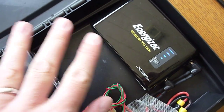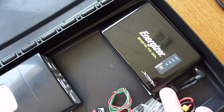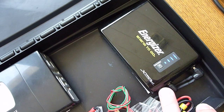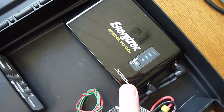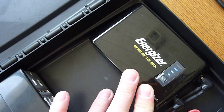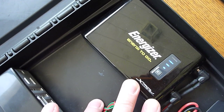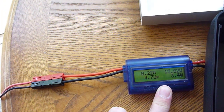The beauty about this system is that there are no solar chargers here. As I discovered, this little lithium power pack requires a 20-volt DC adapter to charge it, and that's about the power range that comes out of a solar panel. It accepts a wide range of input voltage — at the moment it's getting just shy of 16 volts. It's almost acting as though you don't need a solar charge controller, because the charge control electronics are inside. And where you normally have power loss on a PWM solar charger, this is almost giving you the benefits of an MPPT charge controller, because it allows you to pull at the full voltage of your solar panel and get more watts in.